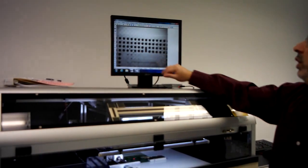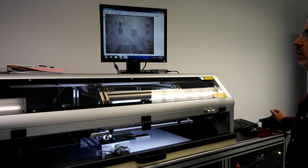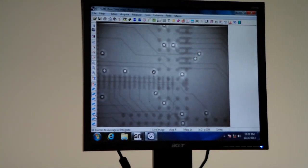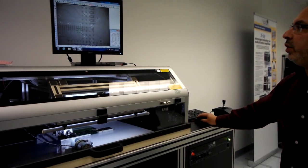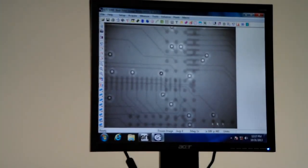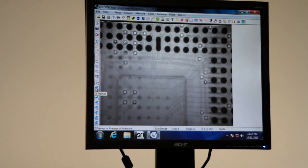These are the typical defects you're going to see: we've seen voids, we've seen shorts. By rotating, we were able to see insufficient reflow. You'll be able to look for inner layer-related issues, die-related issues, wire bonds, QFP packages, and QFN packages. This is the RTX 113 HV system — you can see it's compact and very simple to use. It has additional features: we can do video recording, we can do a three-dimensional rendering which looks at the gray scales of an image and creates a three-dimensional perspective. This is all part of the GTI 5000 imaging processing software. The RTX HV is a very popular system for contract manufacturing, for the primary issues of defects as well as process indicators.